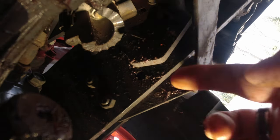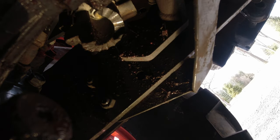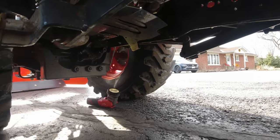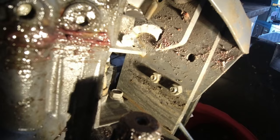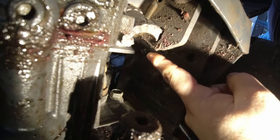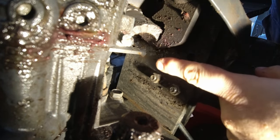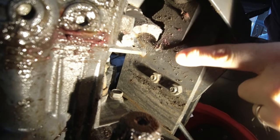See that arm there — the arm goes down and then it stops. These arms will only go down a certain distance because that's what I've set it for on the knob. Now you can see this bar has engaged the teeth and I'm no longer able to rotate. This tooth is engaged on that spindle that was rotating — this means it's locked. When people say 'I can't rotate it,' it's because their three-point attachments are lowered and it's engaging the teeth at that specific spot.